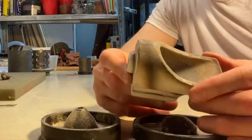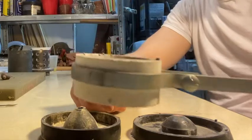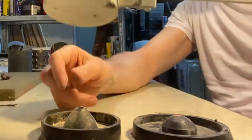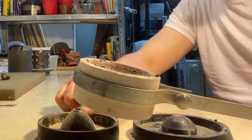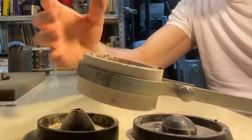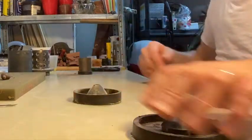That's the crucible for a centrifuge — where the metal gets melted with a torch. The other type looks like this, and when using the vacuum machine, you melt the metal in it and just pour it right in the top. That has fewer problems because you're not locking it together and spinning it around.